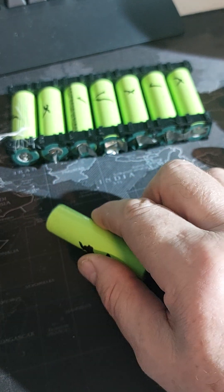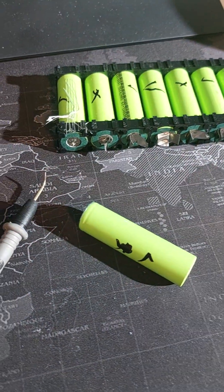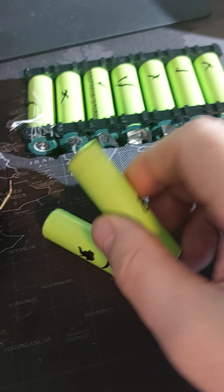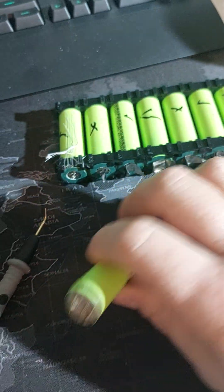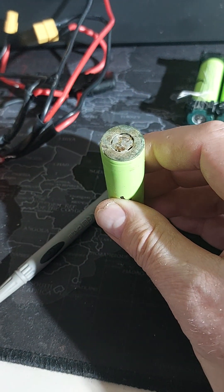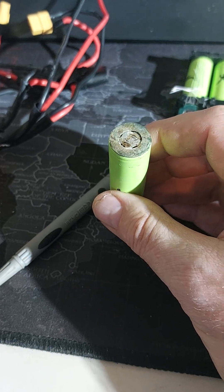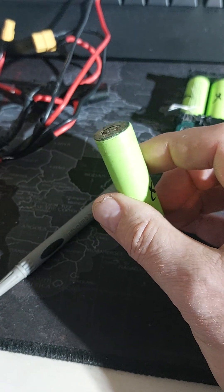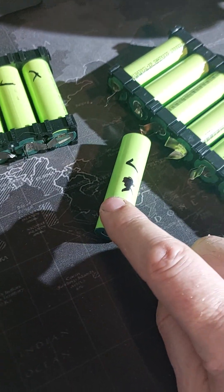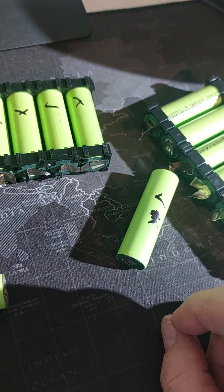And if you look at the colour of it, it's green. As far as I'm aware, practically every single one of them is green — there's no other colour. But look at the colour of this one — I'll compare the two. So this one is dead, and what I think has happened here is that we've got leakage internally from the gunk stuff that's inside, and that has affected it. Let me just see if I can get some kind of reading on it. Normally these cells are around about 50 milliohms, or 0.05 ohms.